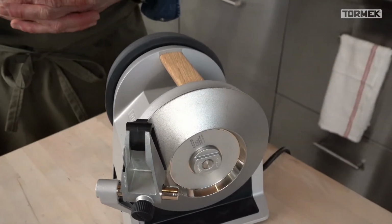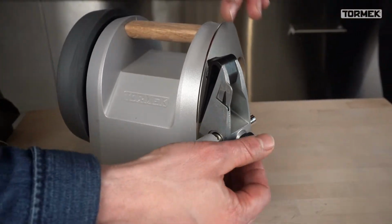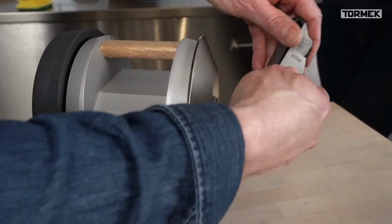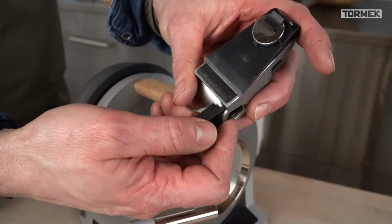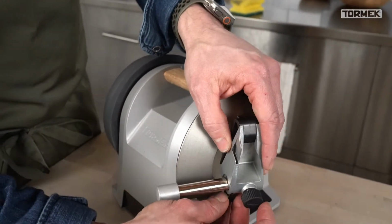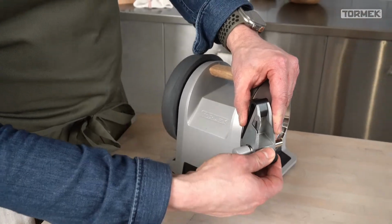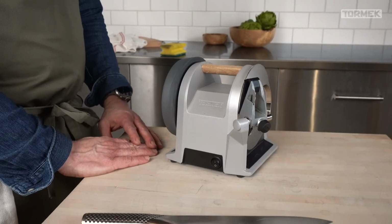The jig, when it's brand new as well. True. It actually wears down a little bit, and that's perfectly normal. It's at the very tip of it. It should be worn down. This will happen, because we want it to be as precise as possible, so it comes very close to the grinding wheel. So that's perfectly normal, as you say.